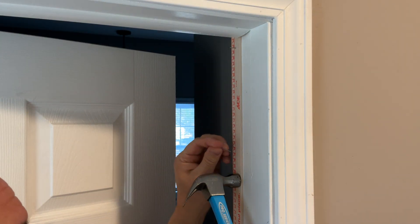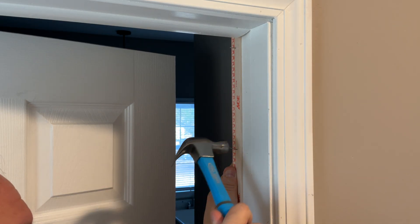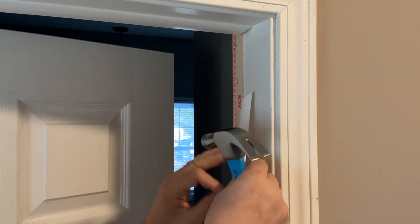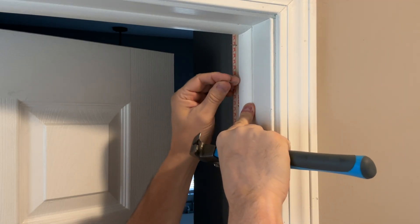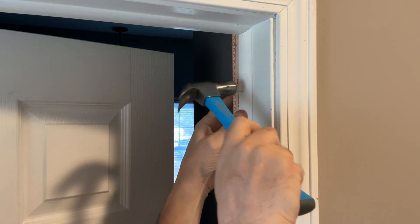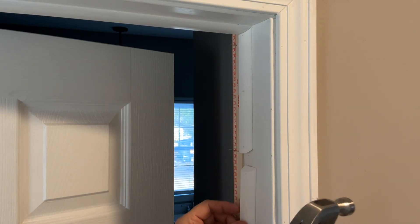When I was done the surface quality was pretty good. You could see a little bit at the very top there's a wide strip, but overall I was pleased — and the existing molding with its paint isn't that smooth anyway. So I printed a whole bunch and was ready to go. I took a wooden yardstick and nailed it in place with the nail sticking out so I could easily remove it, giving me a nice straight edge to lean these pieces against so I'd have straight molding even though it's in sections. The first piece slid right up and matched the molding perfectly, so I put a nail right at the center to hold it in place. The nails slid through and the head was big enough to hold it and recess — just like I wanted.